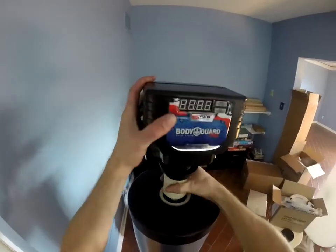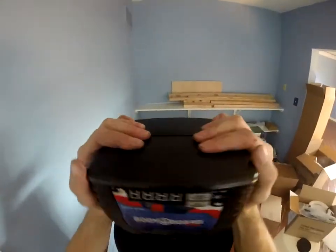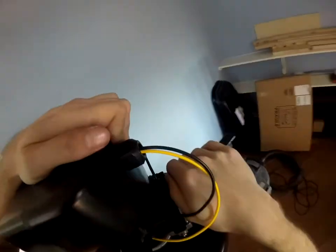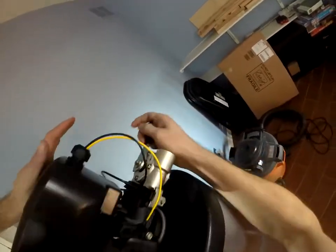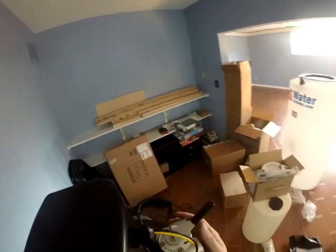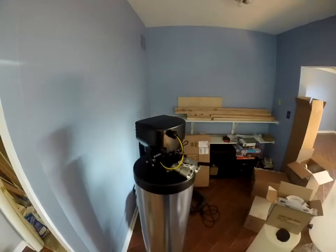You can see the little keys here on the upper basket correspond with our little points here, so you press it in there and rotate it — it doesn't take much, but it stays there. It goes over the distributor tube. It takes a little force to get it down on there, but you get it down to about where the threads are. Press down and thread it on. Then hug the tank and just snug it up a little bit — it doesn't need to be super tight.